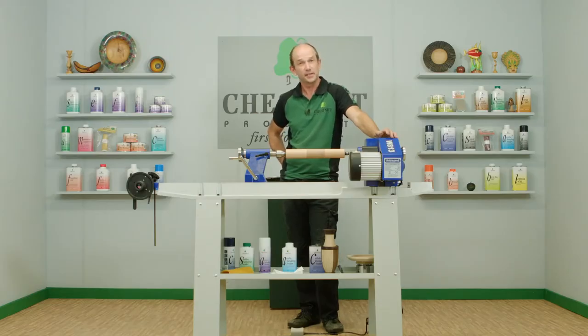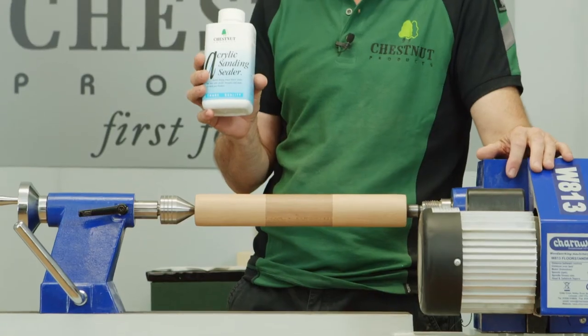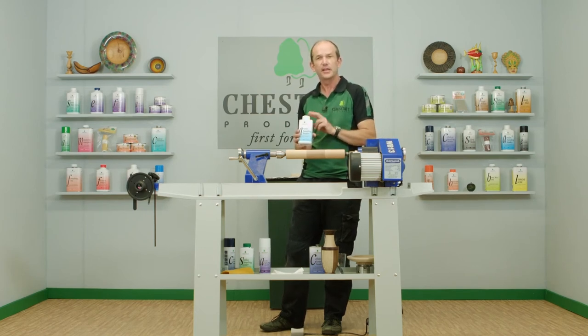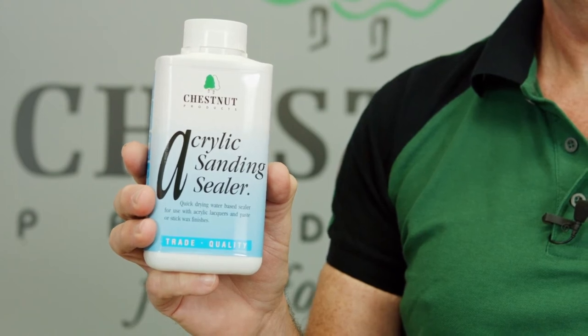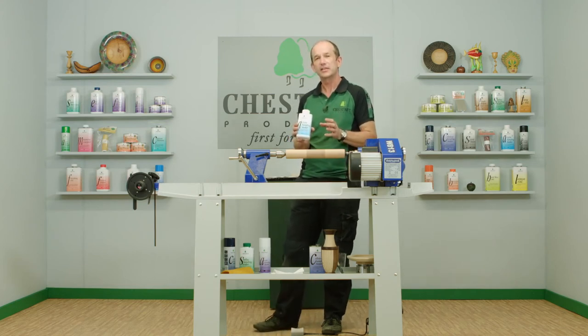The last sanding sealer I want to talk about today is the acrylic sanding sealer. This is a water-based sanding sealer and it's a little bit slower drying than some of the others — about 20 minutes if you're going to overcoat it with wax or polish. If you're going to put the acrylic lacquer over the top, you should leave it a couple of hours. Being water-based, there's virtually no smell and no flammability problems, so if you're unhappy with solvent-based products this is a great alternative. It uses what's called non-grain raising technology, so it doesn't raise the grain either. It is a little finicky in application though, so a little care and patience is required, but you will get a great finish from it.